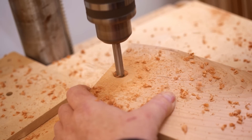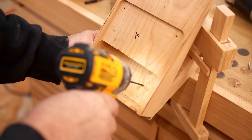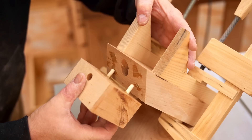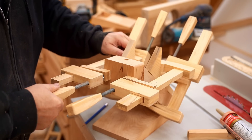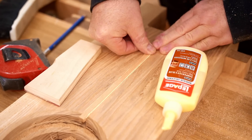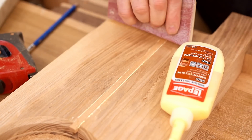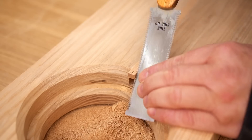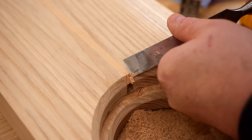Then I did some final sanding and started putting the stand together. The first joint is the base to the upright — I'm using glue and screws to fasten those together. The next is the insert to the upright, this time using glue and dowels. The slot I'm routing in the back of the baffle is once again for the wires that connect to the crossover. I could have drilled it but I didn't have a drill bit long enough, so I routed it out, then I'll glue in a strip on the outside and that leaves me with a square hole all the way down through.